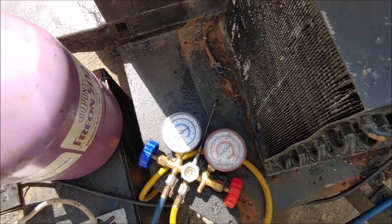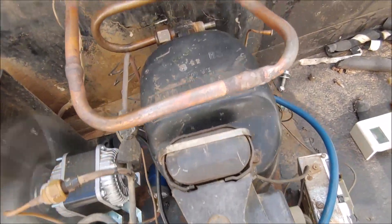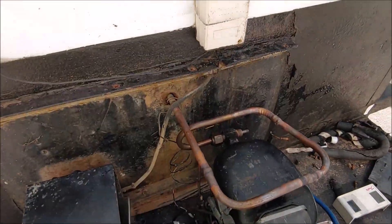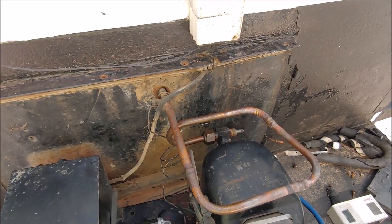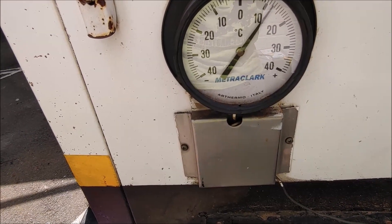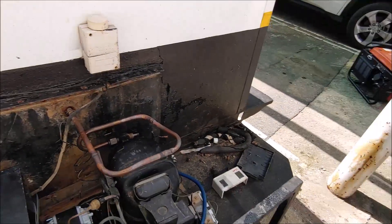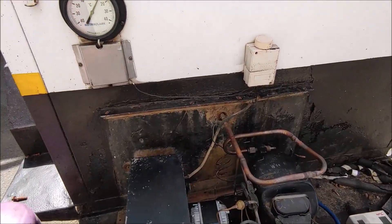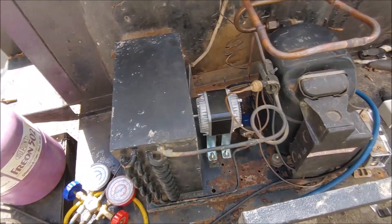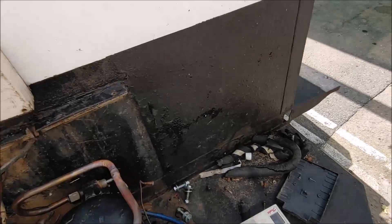The suction pressure gauge is running quite low, it's pumping nice and hot, and it sounds much quieter than before. These trailers take a good 12 to 20 hours to reach temperature. It's only been on for about 5 minutes and it's already going to 12 degrees Celsius below zero. Our ambient temperature outside here in Johannesburg is 30 degrees plus, so it's extremely hot outside. This freezer doesn't fit inside my shop so I'm doing it outside in the sun.